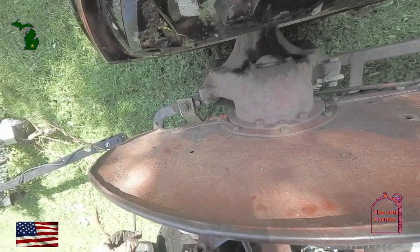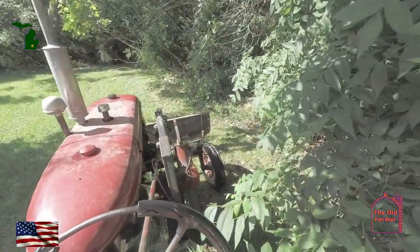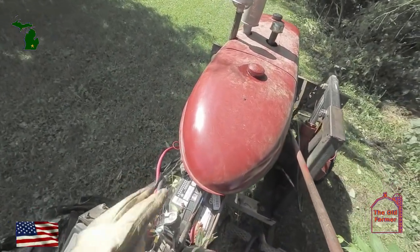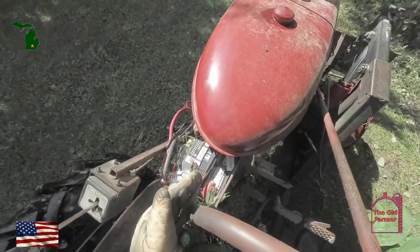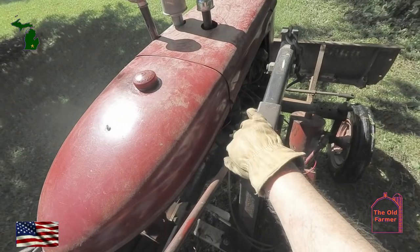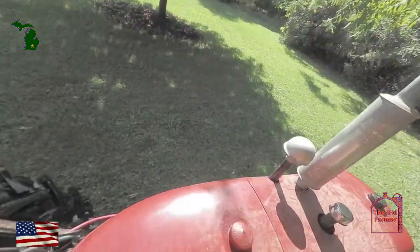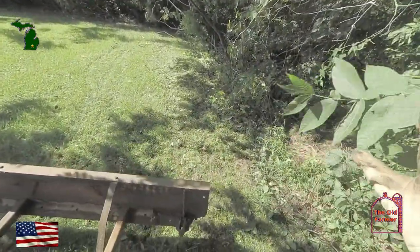The machine itself is constructed solid. There's no debate in my mind about that. There should be a shroud or hood over at least the electrical components and the rubber gas line. I will have to fashion something or have a shop make one for me. It will not be a problem if all you mow is pasture land, but if there are branches, a shroud is a must. This is a bad design flaw with no solution offered by DR Power.